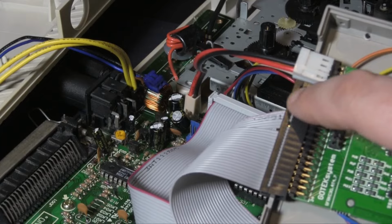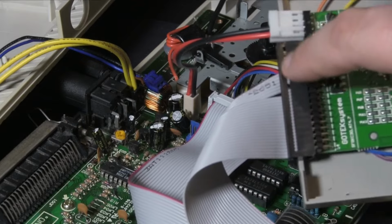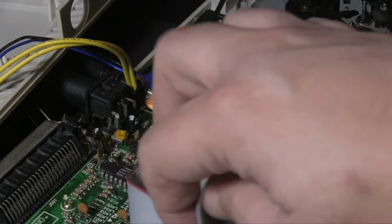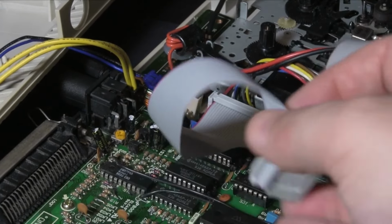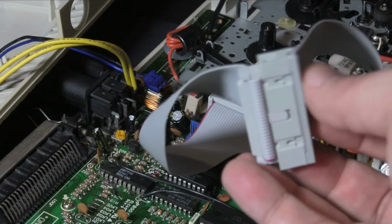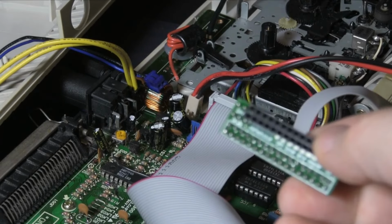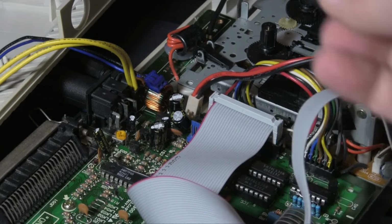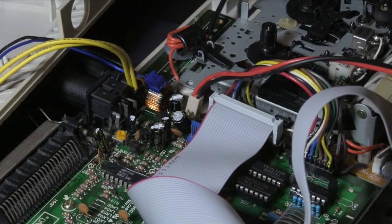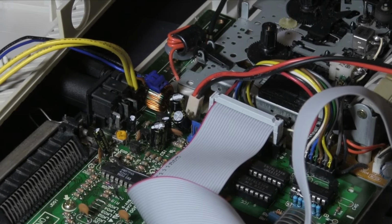Now there are cables you can buy. So this cable goes from 26 pin to 34 pin. You can see it splits the cable and then uses a certain number of pins. I have got a GPIO cable for a Raspberry Pi, because it's 26 pins, which is handy, and that's going into the connector for that. There are also these little boards, which are freely available online if you search for them, or you can buy the PCB ready, and they're easy enough to make up. They go in there and convert it to a normal floppy connector. I found that unwieldy to use, so I changed what I was doing. Anyway, now those are plugged in.